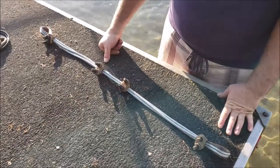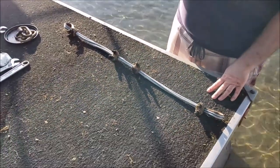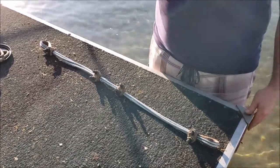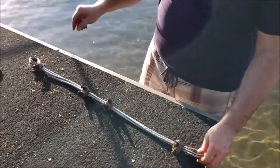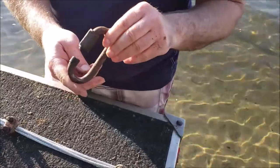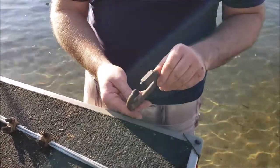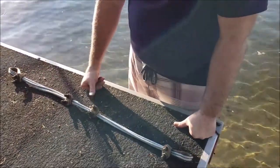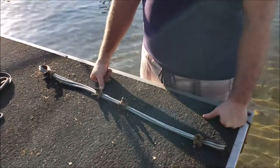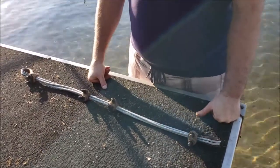The way we rig this: it goes underneath our swim raft connected to one of the galvanized steel cross members. We've got an overhead lifting-rated American-made forged eye bolt, then we put in a master link — breaking strength on the master link when brand new is like 46,000 pounds, so the swim raft will rip itself apart before that will break. Then we go: forged eye bolt, master link, shock absorber, then 3/8 plated chain in the water, from our secondary weights to our primary weights.